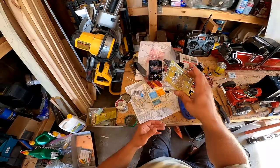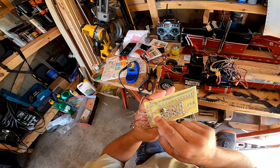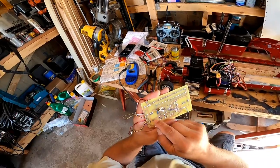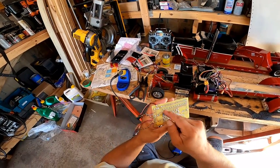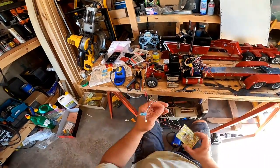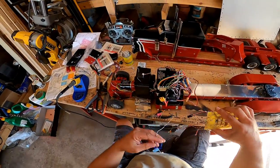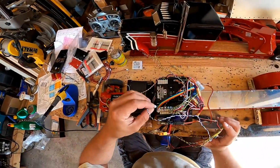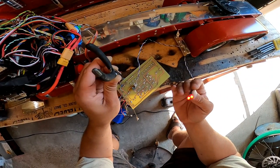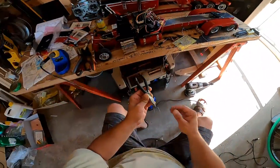That doesn't. All right, well, what happened there was, first I had connected to my normally closed. It needed to be to my normally open. So I went and I broke all those contacts. But then, turns out, I had the wrong relays. So I checked, they weren't working. So I double checked the data sheet. Those relays, I had the wrong ones. They were like 120 milliamp relays. This won't power 120 milliamp through an LED. However, one thing I'm noticing is they're not quite as bright as I would like them to be.